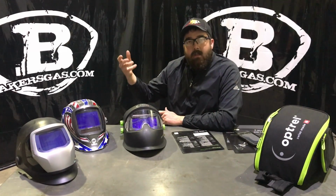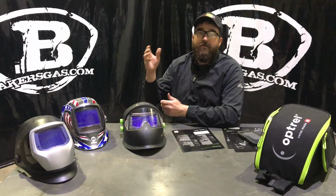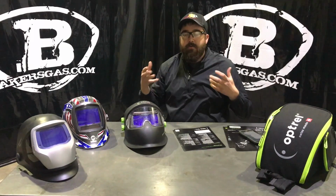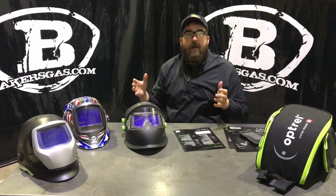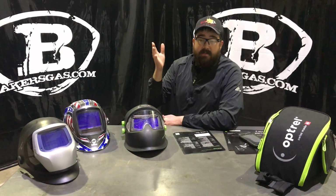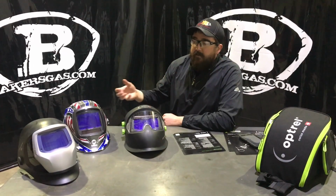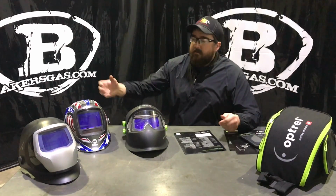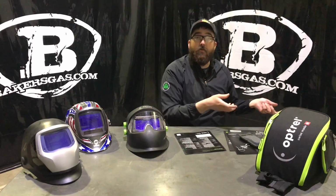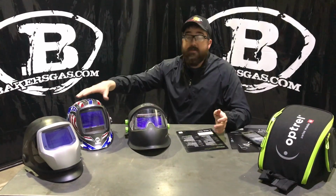So they chose a lower angular dependency to get you to that shade 3, shade 2.5, and shade 3 in your dormant state when you're not welding. And I hope that all makes sense. They said that they wanted it to be lighter when you weren't doing anything because they felt that it sped up productivity, right? So as long as your helmet's down, you can still grind, you can still grab your chipping hammer, you can still grab everything in the midst of doing all that with a shade 3.